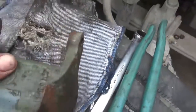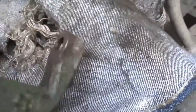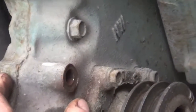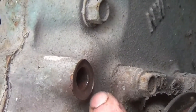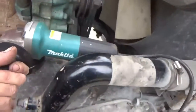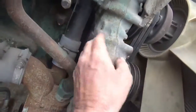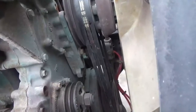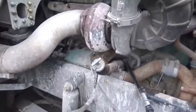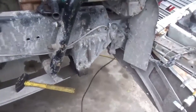I am ready to clean this thing up. I've got to do a little bit of grinding on this side here — I'm going to take that in and do that on the bench grinder, get that flat. And this one here I need to do the same thing, but of course I can't do it on the bench grinder. I took a four and a half inch grinder and put a new grinding wheel on it, because I want it nice and flat on the side I'm going to grind with. I don't think I need to mess with the rest of these — they're worn out inside the hole but there's nothing I can do about that. I can't do a permanent fix on this thing right now.